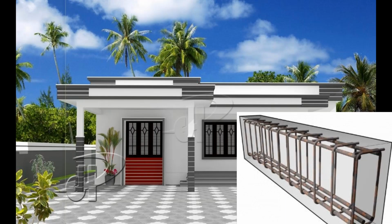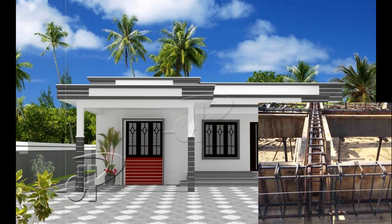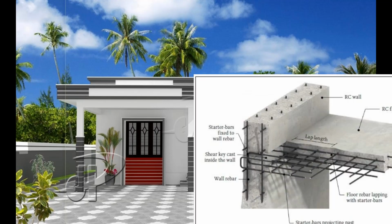If, however, you are going to use a slab roof, then you are going to have to consider a more robust type of belting. That belting will involve having, as I said before, a rebar cage. However, this rebar cage does not have to involve the extreme amounts of steel, of rebar, that would have been necessary had you been putting a second story on top, because your slab is going to be much thinner, it is going to be lighter, and it is going to require a bit less reinforcement because it will not have to hold up that vast amount of weight. As a result, it will be less expensive to manufacture.